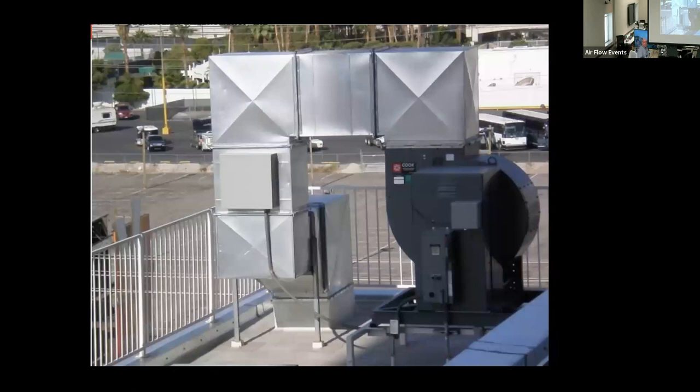Now, just as you can have problems with a power roof ventilator, you can have problems with a utility vent set. This one, I still shake my head about every single time. And one of the benefits of this particular product line, it has a field rotatable scroll. Everything in this photo could have been averted. So, one of the things that I've been challenged with, and I do a lot of discussion and education upon, is rotation and discharge. I've had to do more classroom topics on that in the last 3.5 years than I've had in my entire career at Cook.